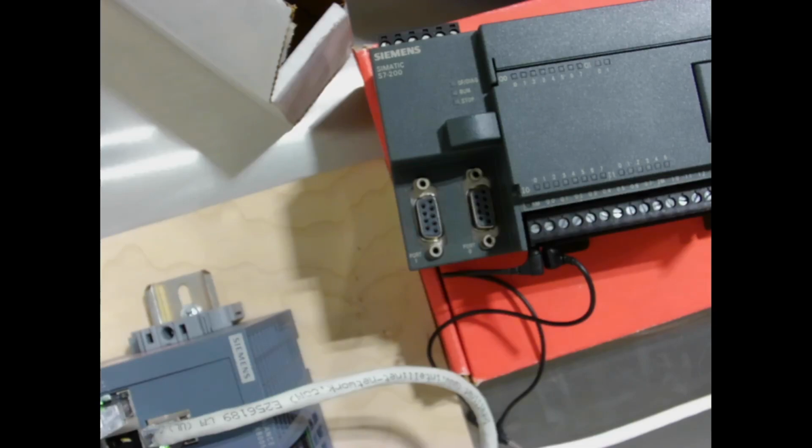Now, for those who don't know, a 5K is what, like 3.1 miles? So this is roughly, what, 24, about 5? So about 15 miles is how far you can send this. Now, notice there's a little asterisk on that one, right? This is not going to be over traditional twisted pair over 15 miles. No, this is going to have to include repeaters and fiber optic transmission if you want to go that far of a distance on Profibus.